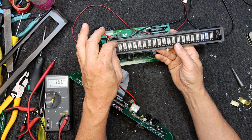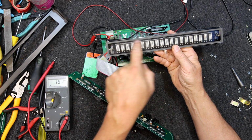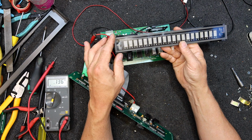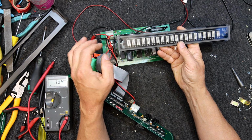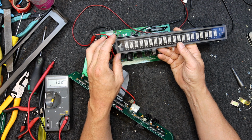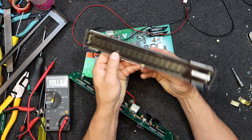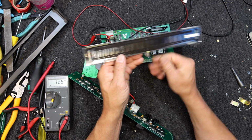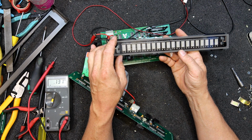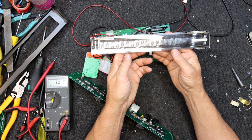And so each dot is like, a bunch of them will flash on, I guess, more than likely. They've got all these high plus 1 line, so that'll light up on a whole bunch of segments. Then it'll move to the next dot on all on the displays that use it, and so on. So this one would sort of scan across all the rows until it gets to the end. Now, of course, it could scan in any direction, any sequence. It doesn't have to be sequential or anything. You can do them in any order you want, but they're all flashed on very briefly. And our persistence of vision, probably a bit of persistence of, I'm not sure if they use phosphors in these or what they are, but probably some persistence in the light from these plus our vision, and it just looks like it's glowing all the time that way.